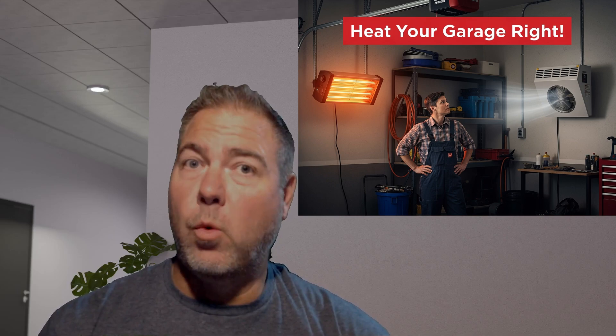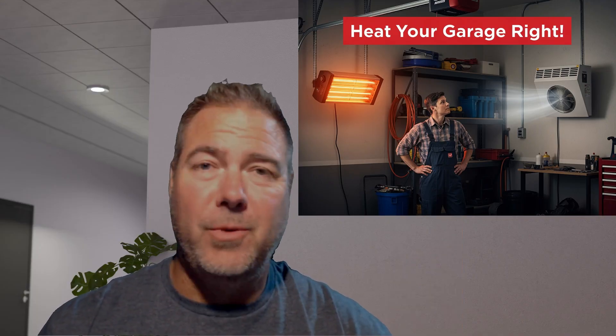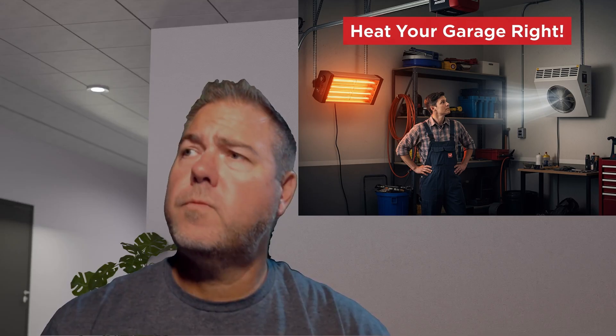When you're heating the air, the air is what's warm but all the objects in there are cold. If you open the garage door for ventilation — for welding or painting — you're letting cold air in and warm air out. You'll use extra fuel to recondition that cold air, resulting in longer run times on your unit heater. When you close those doors again, you have to wait for the heater to run until the air is warm again, all controlled by the thermostat.